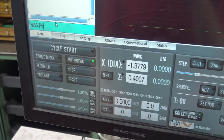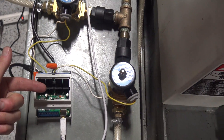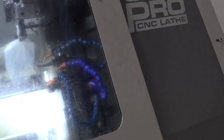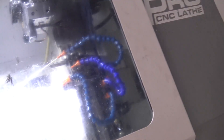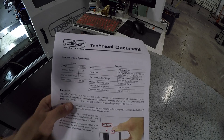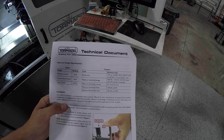Let's turn the solenoid open first so we're not running coolant without a valve open. M64 P5 should start the turret coolant — that opened the solenoid for it. So now if I turn on the coolant, boom. Now if I type in M64 P6, our drill coolant should come on — it does. And now I can turn off the turret coolant. It's also very important to know the rated load of the relay in the circuit board itself. You can see here it can handle 10 amps at 120 volts, and our solenoids are inside of that — an important thing to know and stay within.